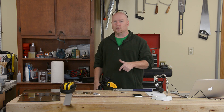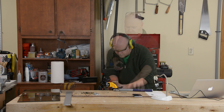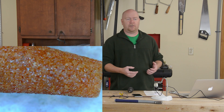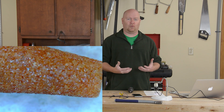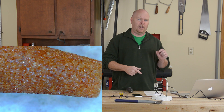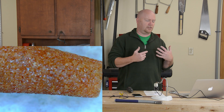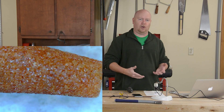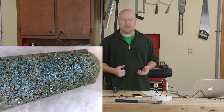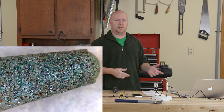Let's try the same thing with the much harder tool steel of this hatchet head. We've got brand new stones in the Dremel tool — same 30 second test. Steel is pretty much steel from a grinding perspective. The tool steel is harder, so probably if we measured these things down to the thou or 10 thou, you'd find that we wore away the stone a little bit more. But the wear is real even and the stone is still perfectly usable. There's not a thing wrong with the cheaper aluminum oxide stone. Likewise with silicon carbide — it's only 30 seconds of grinding, that stone might as well be brand new, and there's going to be no appreciable difference between this and the aluminum oxide.